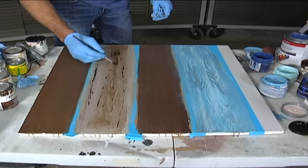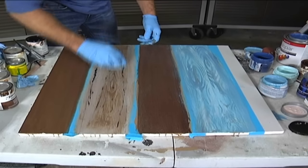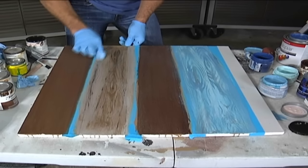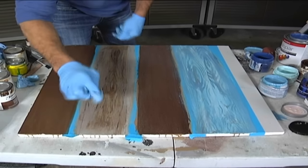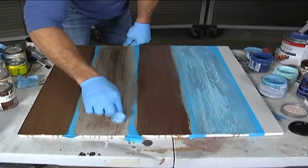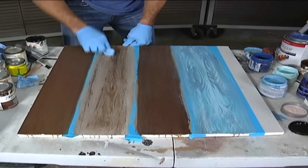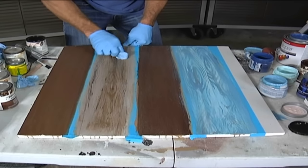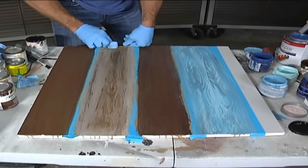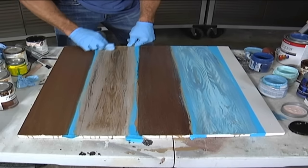I kind of follow the grain on some, and then we'll just streak it in. The more you rub it, the more you're going to bring out the ridges on it, the high spots. Those are going to get darker on you. And those are from the stainable primer when I pull the grain on it. It's raised a little bit, so you rub it, and you'll make those more prominent. See how that's coming out more? I want to do that for that knot.